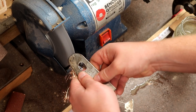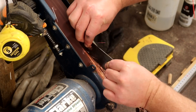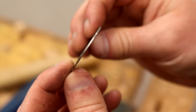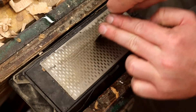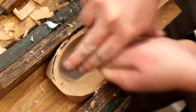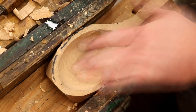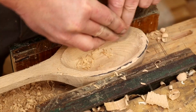Here I'm making a rounded scraper using some steel from an old handsaw. I shaped it on the grinding stone and then polished the edge on a 400 grit sanding belt, holding it as close to 90 degrees as possible. Then I polished the faces on 360 and then 600 grit diamond plates, and I did the same with the edges too. Then I burnished the faces and then the edges using my burnisher until I could feel a burr along the edge. I'll leave links to all of the tools I used in the description box. This scraper worked great — I could have just sanded the bowl of the spoon, and that may have been slightly quicker than making a scraper from scratch, but now I have a round scraper I can use on future projects, and scraping leaves a much smoother finish than sanding and it's also quicker and more enjoyable too.